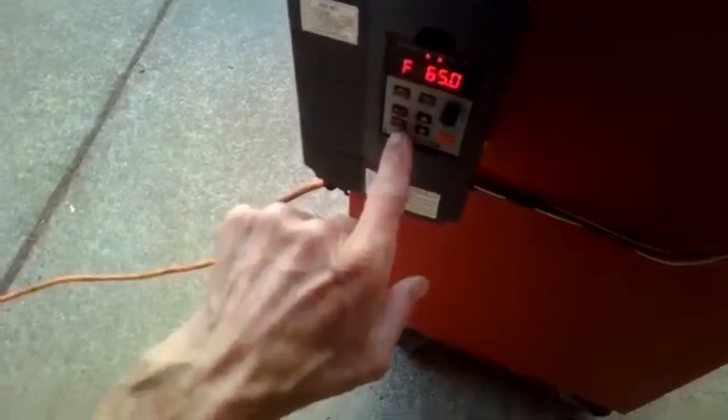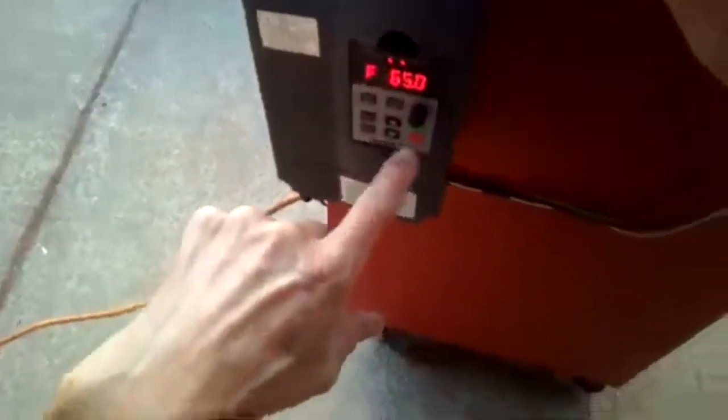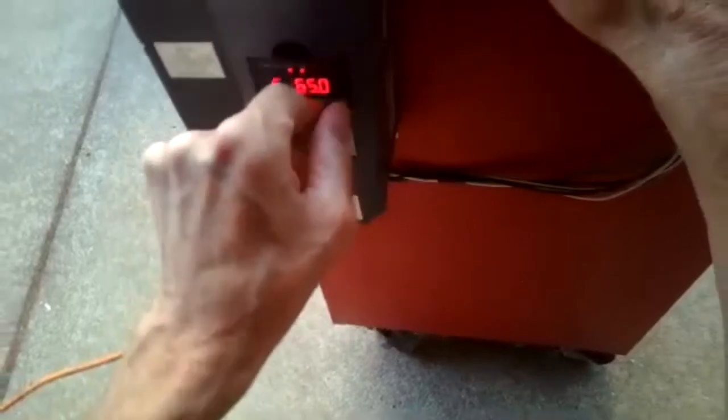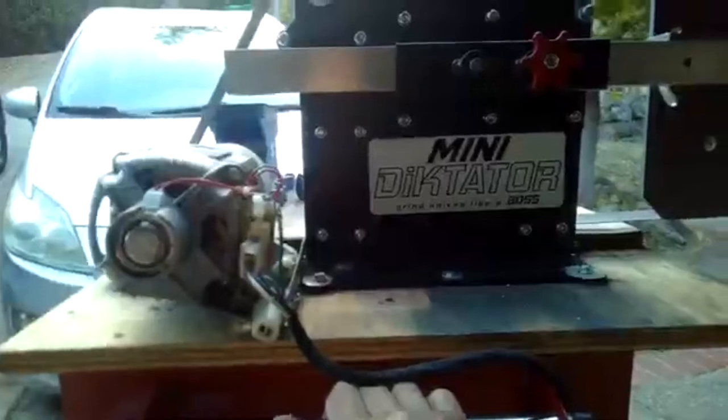So we've got the VFD set up with this motor, and we've got a stop here to keep this plug from being pulled on, keep these wires coming out to the motor from being pulled on. Let's put a little goofy coffee filter here to keep particles from being sucked down, but air can still pass through. There's a little fan on the bottom. I'm going to try out this grinder motor. So this is just mainly right out of the box. The only parameter we changed is the frequency from 50 to 60. We're going to say run. Turn it all the way down. Say run. Bring it up slowly.